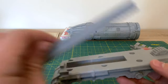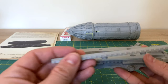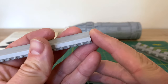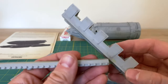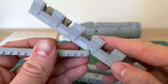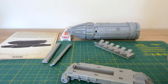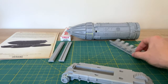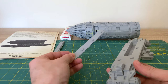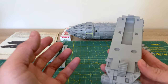Rather than enlarge the holes in the chassis, I'm going to cut the locating pegs down — that will be easier. It will be a bit long at the front but I don't think that will matter. If it does, my next plan is to cut a chamfer down so it can be a little bit further recessed, though there's only about a millimetre to play with there at most. Both rails are suffering from the same issue. I'm going to try fixing it rather than requesting replacement parts this time — apart from the sizing issue, they do fit, and I have a relatively straightforward solution.